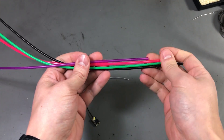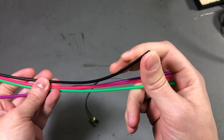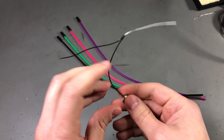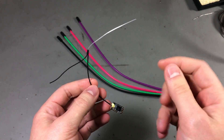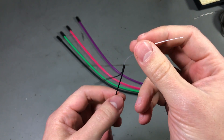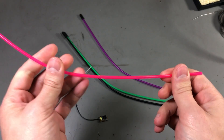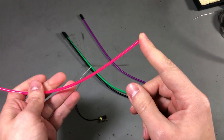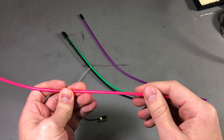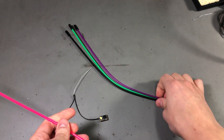My next item is a set of colored tubes for antenna protection. These are about 3.3mm on the outside and something like under 2mm internal diameter. In the RC world you often have thin wire dipole antennas and high speed crashes, so to protect these fragile antennas we 3D print some fixtures and then use this tubing. This rigid tubing also holds the antenna upright or in a certain position for the best radiation pattern. I got 4 of these and they should last me a while.